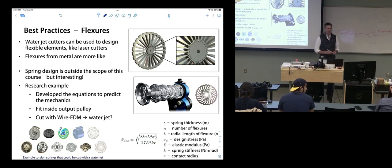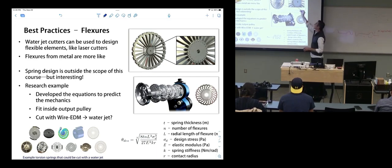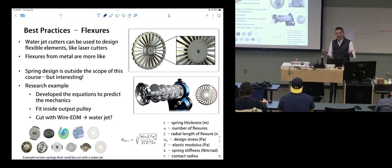Yeah. For actually fitting the gear into the springs, how exact do the tolerances have to be? I guess gears are pretty exact. It's hard to actually get every single tooth in. Yeah, this is made with a wire EDM, and it's a custom profile, so it's like a gear, but it's not actually a gear profile. It is involute, but we just cut it with wire EDM.